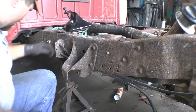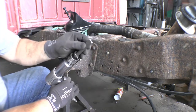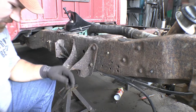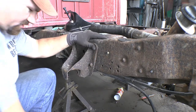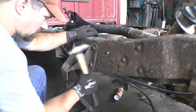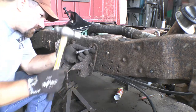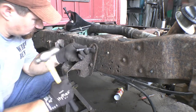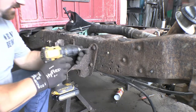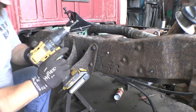Alright guys, if you've got one of these you might try to go at it — I've already kind of worn it down, I'm going to sharpen it. You can beat on it for a while and you'll eventually get it; we found that out with the International. But this trick right here works really cool. Take your hammer and go ahead and hit it, get yourself a flat spot there about centered. Then take your punch and make a nice centered spot right on that rivet. Then get a little hole started with the drill.